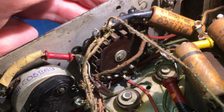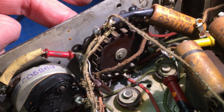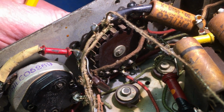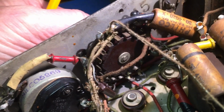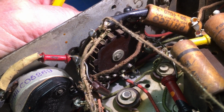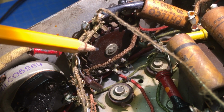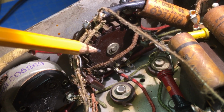Then make sure I get a good spacer and clip on the front to hold this shaft that way and to hold tension on that detent in there. So it does that. And I think we can repair that. Now, if there's supposed to be 6 and we've only got 5, then we may have a problem, but we'll figure it out from here.